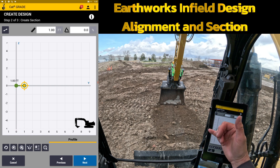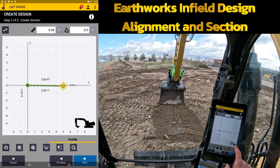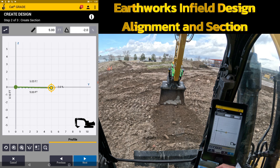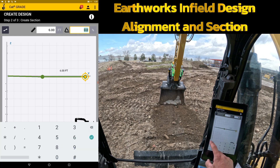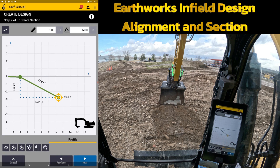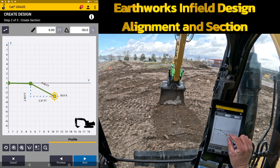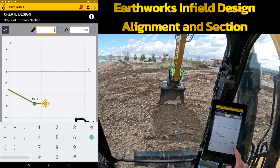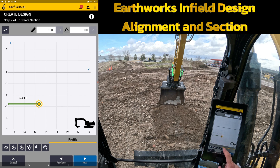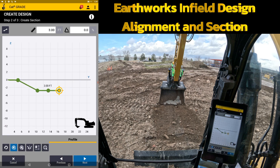I'll go ahead and do both. I'm going to key in a number here. You hit the blue button to get the cross section started. I'm going to say five feet at minus two percent to create a little flat plane off to the left side. Now to create my V-ditch down in, I'll hit plus one more time — six feet at minus fifty percent to give it a slope down in. Since I know the very bottom of my ditch is where I want my actual alignment, I'm going to create a midpoint in the flat spot: three feet flat to create a point, then another three feet flat to establish the midpoint.